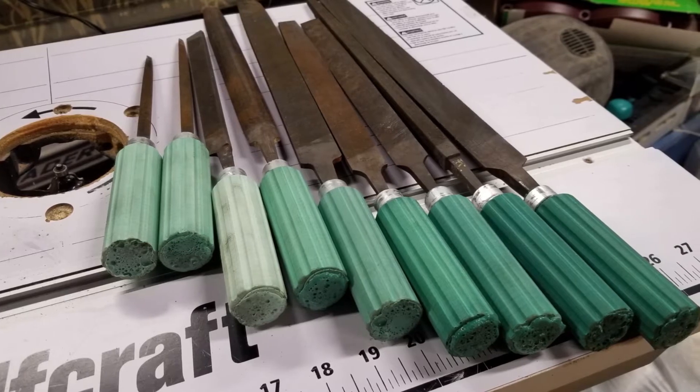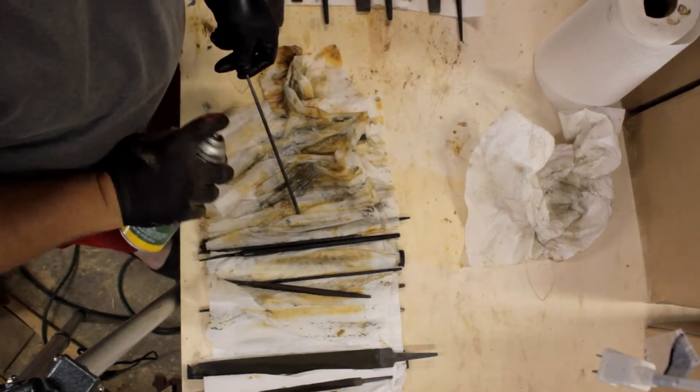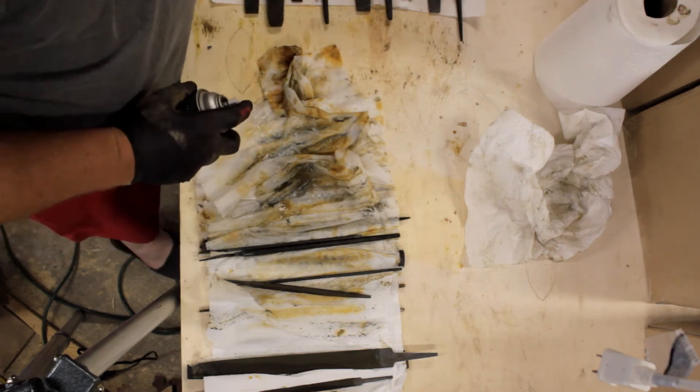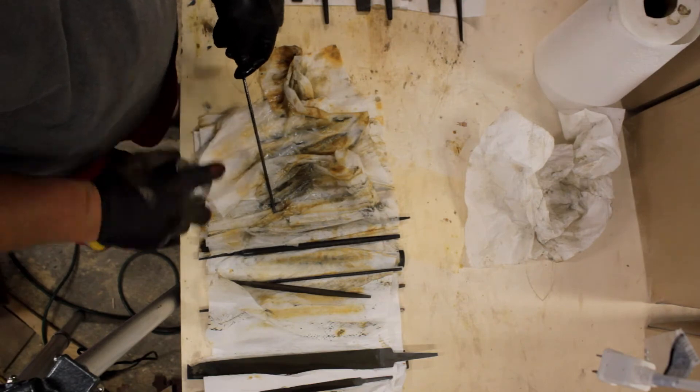There are some things I would have changed. I would have definitely used a better neutralizing agent on the files, because I think there is still some residual vinegar left on there — they are kind of getting eaten up a little bit quicker than I thought they would. Also, when I took them out I used REM oil, which is basically Remington's branded oil — I think it's probably a water displacement formula, similar to WD-40, not an actual lubricating agent. So next time I would use maybe some used motor oil or something a little bit thicker, maybe some 3-in-1 oil — something that might penetrate those porous surfaces and protect them from rusting in the future. It's a really great way to restore old files, especially when you get them at an auction or garage sale where the teeth are still good — a little vinegar soak bath and they're cutting like they're brand new.